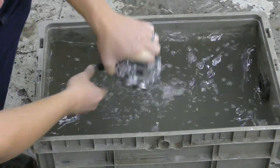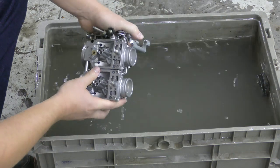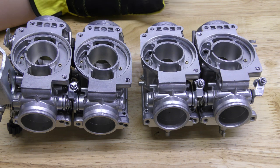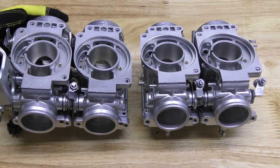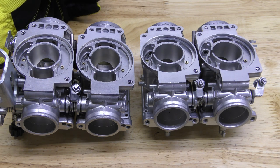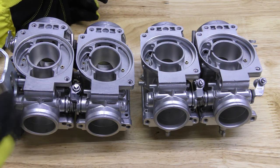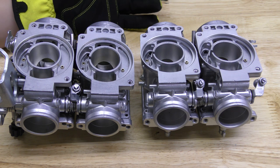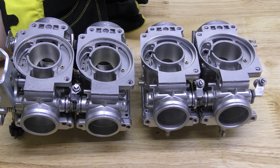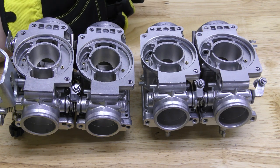I like to show how to clean these delicate parts — the easy way is to put it into a dip tank and slosh the parts around. It really helps remove any trapped media that could be anywhere in the part. Some of these blind passageways and holes have media all over the place, but you can slosh the part around and it really helps remove that media even after you rinse the part down in the cabinet after you're finished blasting.